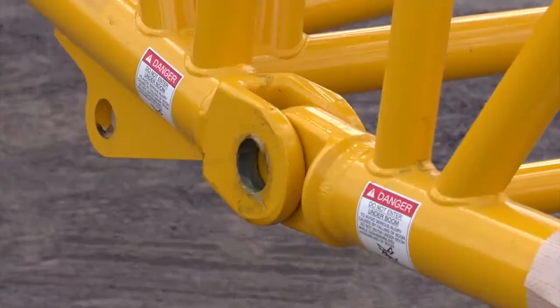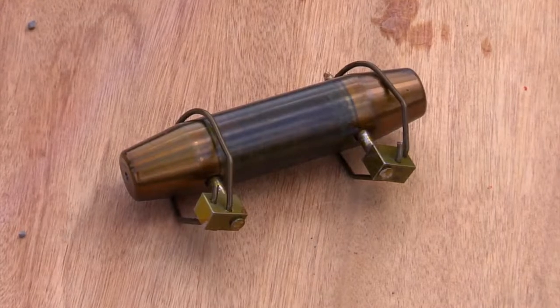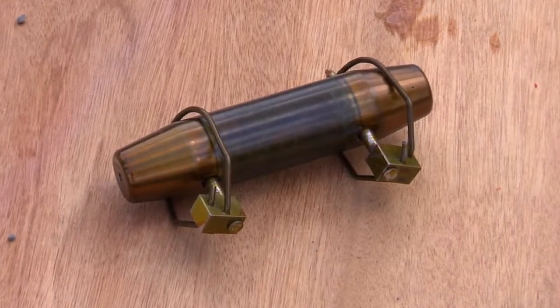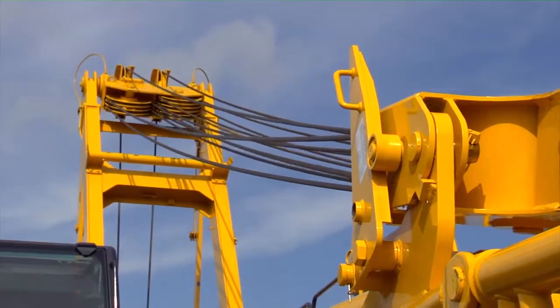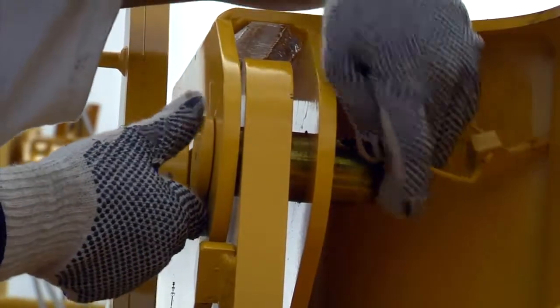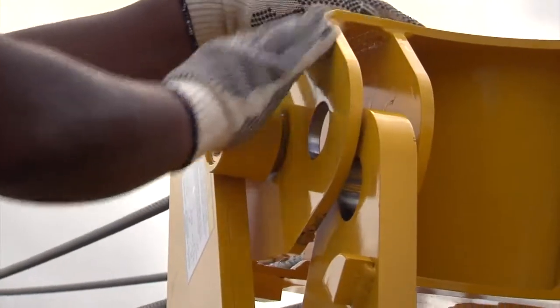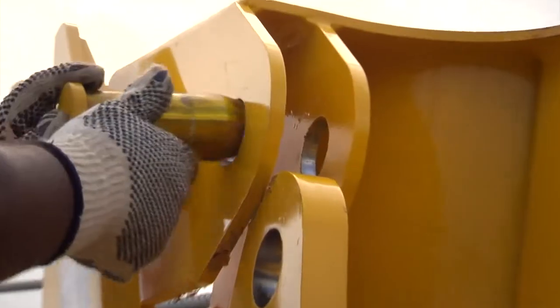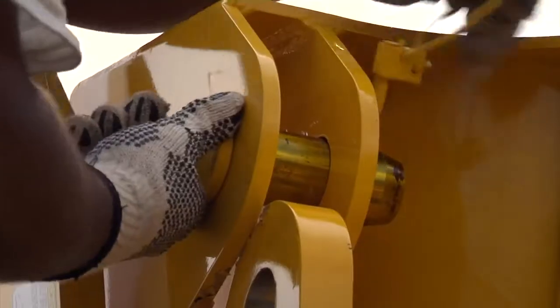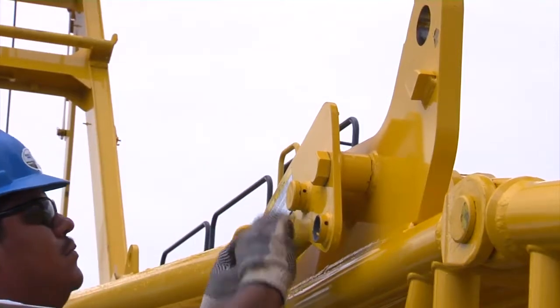Raise the boom hoist to align the bottom holes and install the double taper pins. The double taper pins are needed for a safer disassembly of the boom. Lower the boom to remove tension on the upper spreader. Once this is complete, remove the connecting pins from the spreader to the base. Then raise the spreader to clear the brackets and install the pins on the spreader and secure them with the locking pins. Once again, lower the guide and secure them with the locking pins.